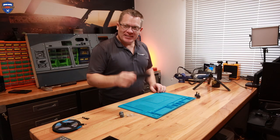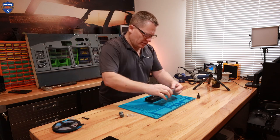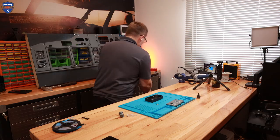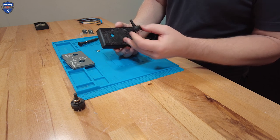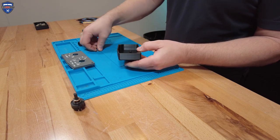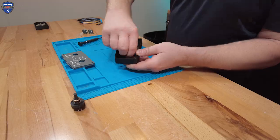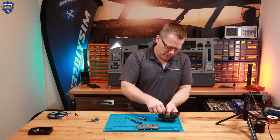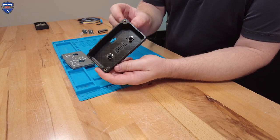That's all the brass inserts done. We've got our lighting back box — let's get some rotary switches fitted. I can see that I've got five positions, and we can set the locking ring. I'm going to place the rotary switch into the back of the unit. We've got the locating tang here, which needs to go into the orifice at the top. Then we can put the locking nut on. And there are our two rotary switches fitted.